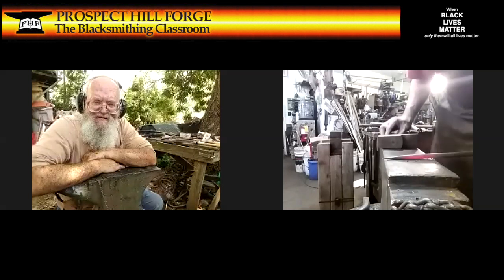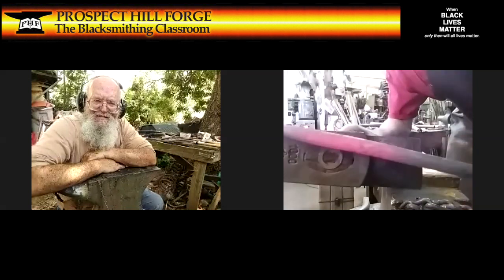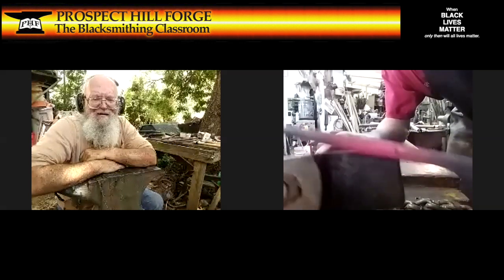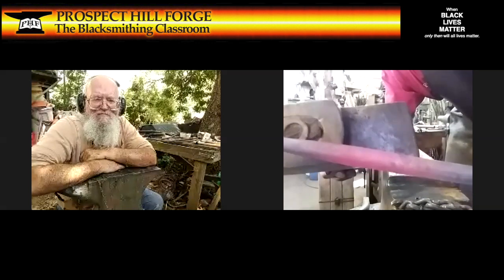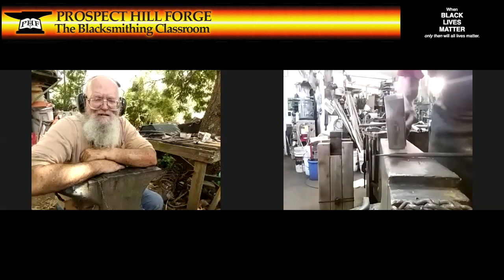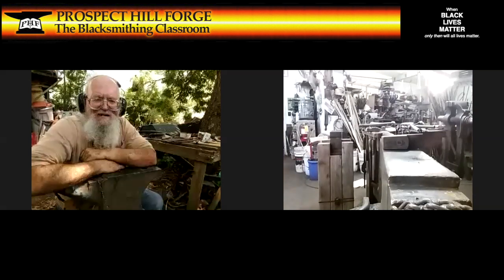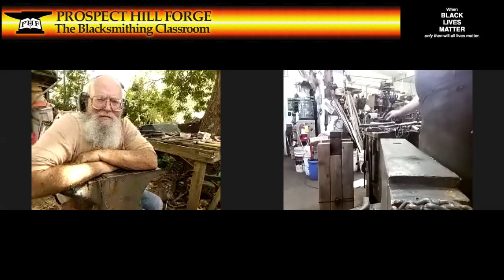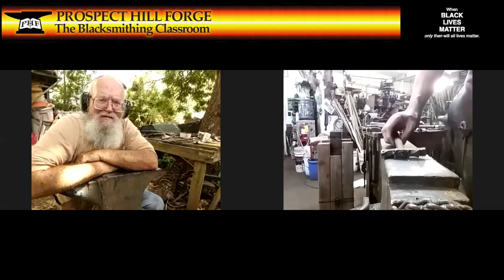There you go. And that, let's see, can we make it so that the camera really picks it up? Yes, I think so. There, all right. No, focus here, there we go. So fairly smooth, and it's got facets running the long way. If you go hammer bang, rounding, rotating like this, rounding this way, you end up with a kind of random surface. And, well, I don't think this is good. I am now swapping to a more smithly hammer for this job, a small one.